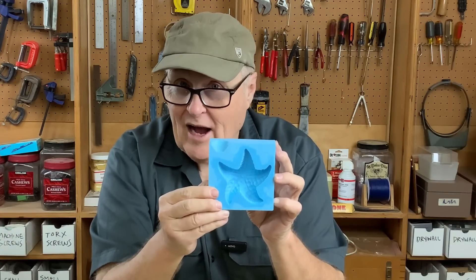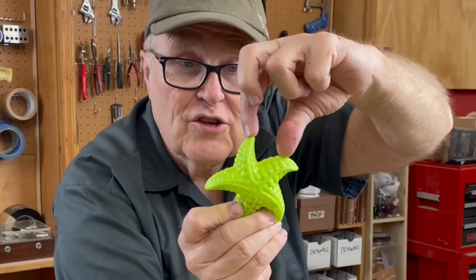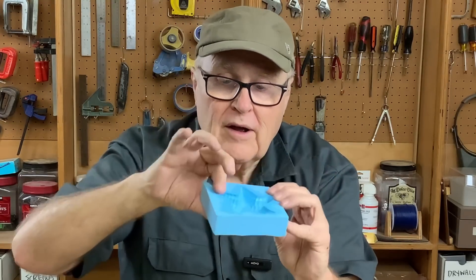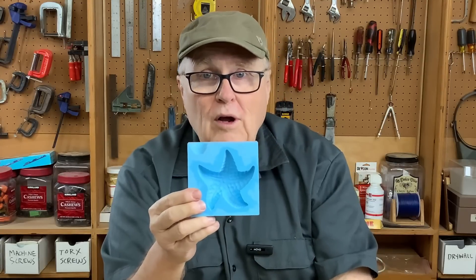That's not quite the most efficient layout. I could have done it with just a funnel and a sprue here and a vent coming off here — just two connections, which would have been the most efficient way. The reason I laid it out requiring a funnel, a sprue, and two vents is that I'm going to do something I've never done on the channel before: I'm going to cut them in, just to show you that's an option. It's not my favorite way to work, but once in a while you make a mistake and have to cut the mold to put in a vent or sprue. So we're going to cut this mold, pour it, and see how the whole thing works.